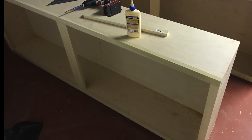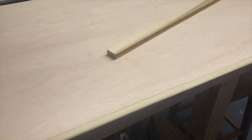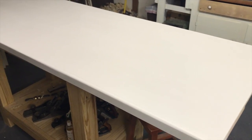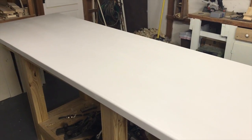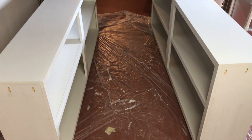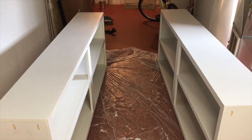I added a vertical support in the middle using pocket screws. Then, using the rest of the third sheet of plywood, I added a piece of poplar as trim on the front so it didn't look like plywood, and just glued and pocket screwed that on, followed by some paint. The shelving units themselves have a floating shelf that goes up and down on shelf pins, and for that one you use plywood with poplar attached to the front.